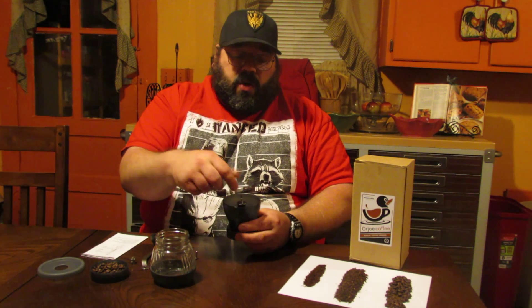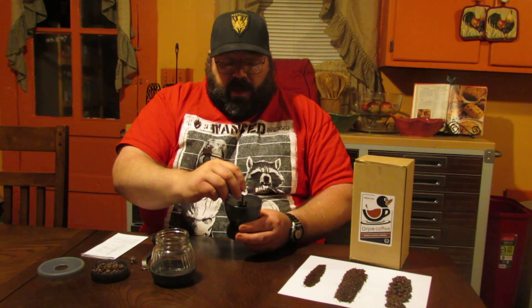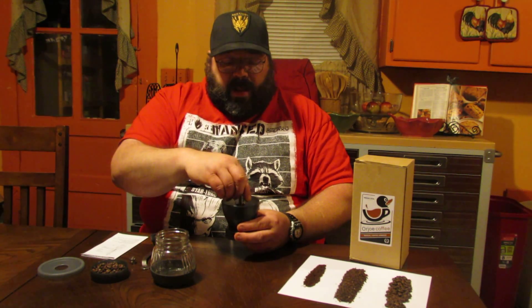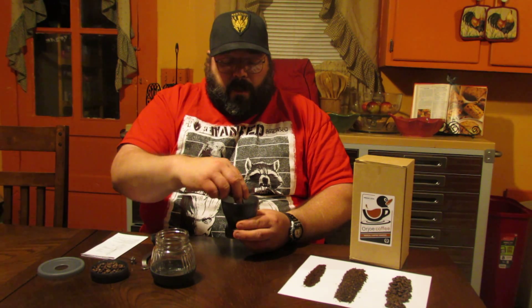As I said, I shut it all the way down and back it up about a quarter of a turn. Then you've got this item here called the stopper. It's got a special shaped top — it only fits on one of two ways. What that does is it kind of locks the adjustment screw into one position, and you see it just sits right on there like that.